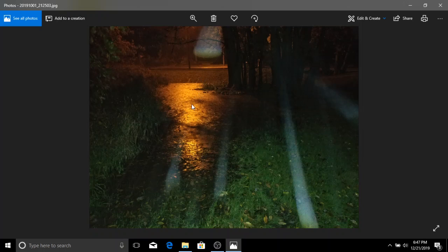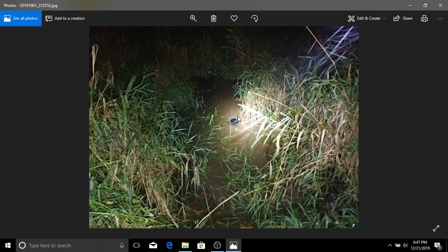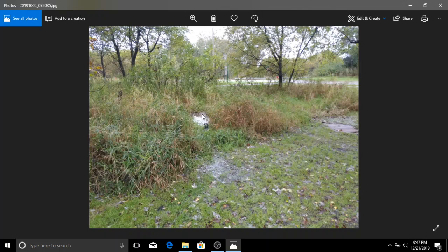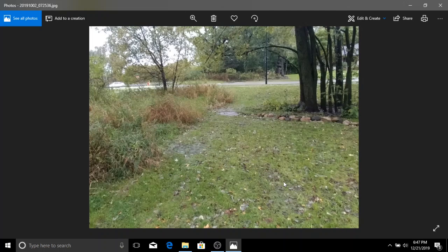That rained so hard it was backfilling into my system. I don't have a check valve on there on purpose, to keep the pipe clear in winter so it wouldn't freeze. But it worked — by the next morning the lake was all clear. It was done — pretty cool. The pump was pumping out in the morning. This is the rear rock stream during the storm — it's totally filled with water. This is the back of the garage — the French drain rings around the outer yard, the berm goes all the way around the whole garage, and here's the rock stream I dug in back.